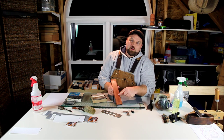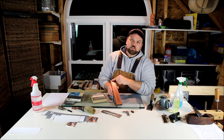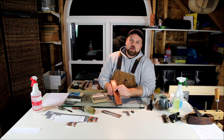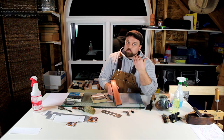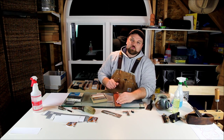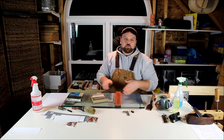What's extremely common is a piece of wood that's been flattened with leather glued to the top — a tight grain leather is usually preferred. You can use diamond paste, buffing compound, or even use it dry. I've got a strop in my bathroom that I hone my razor on to shave in the morning — same basic principle — and I don't use any compound on it. The leather grain itself is enough to hone. You draw your blade across the surface of the leather just like you would on wood. Same concept, there's no magic to it — it's just trying to refine this edge to get it as sharp as possible.